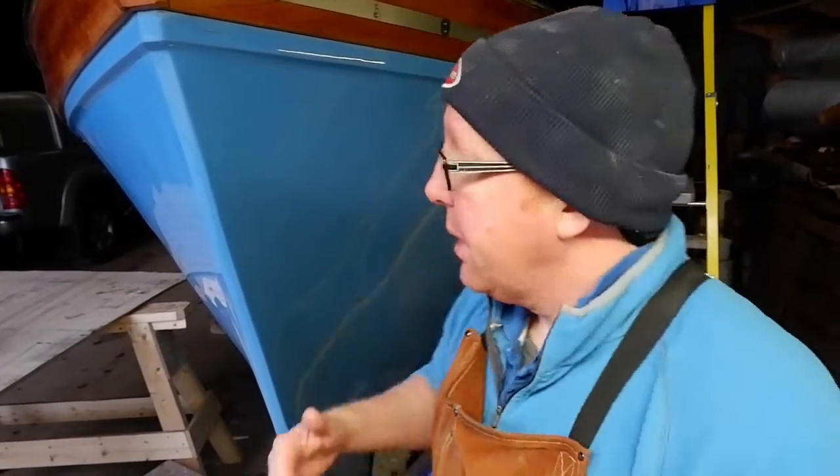Now obviously, a boat is longer than it is wider, so if you have your liquids widthways going from side to side in a choppy sea, that actually helps with the momentum of the free fluid to maybe even capsize your vessel. Now obviously that's a dangerous thing, and the only way to stop that is by putting either boards or baffles in between where the liquid is moving from. So it reduces the size and the momentum of the liquid itself. Mr. Whiteboard will show you what I mean.